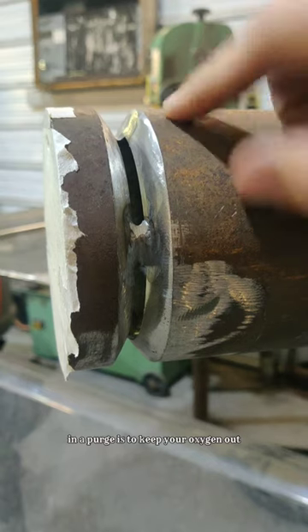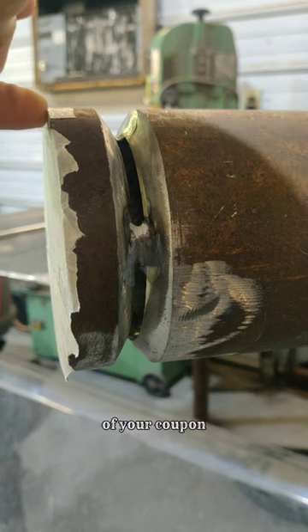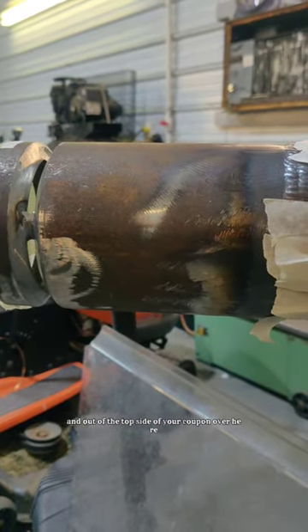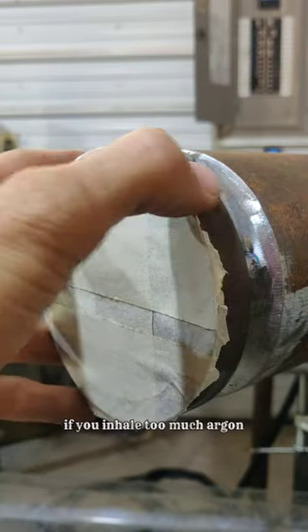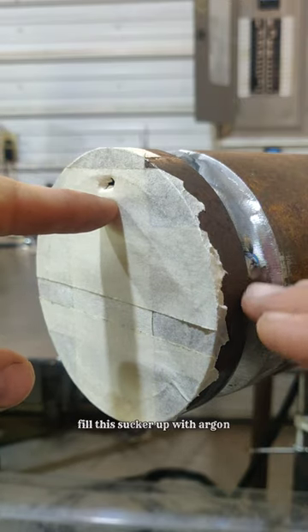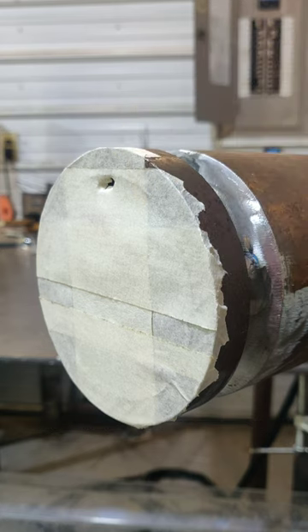You just have to make sure that you do not get oxygen on the inside of your pipe when you're welding stainless steel. That's the whole purpose of a purge — to keep your oxygen out. You put your breather hole to push all the oxygen out on the top side of your coupon, opposed to the bottom where your argon is going in. The argon going in on the bottom is going to force all that oxygen up and out of the top. Remember, argon is heavier than oxygen — it's an asphyxiant if you're in a low place TIG welding all day; you can fill up that spot and get yourself killed if you inhale too much argon. Oxygen will float on top. So poke your hole up top, fill this up with argon, and when argon is coming out, you know you've got a good purge. I hope that helps — drop any questions in the comments and I'd be happy to help. Thanks for watching.